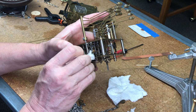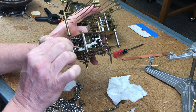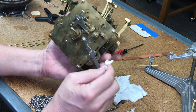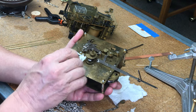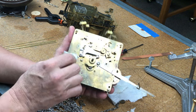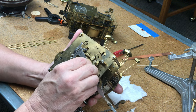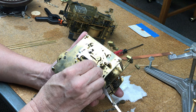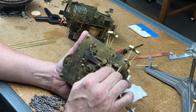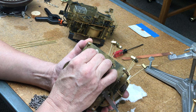The oil I'm going to use is oil that my father was experimenting with a long time ago, and it was a surefire winner. It's a blend we use today and it has proven itself over ten years to still have good lubrication qualities. So instead of two years, as the manufacturers of grandfather clocks suggest, we suggest servicing every six to eight years.